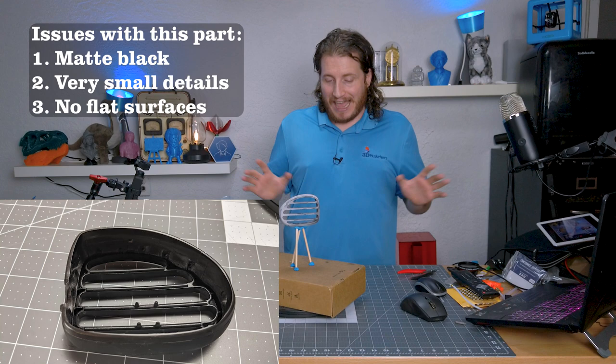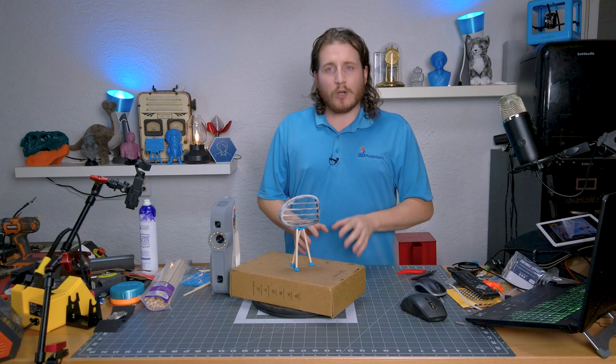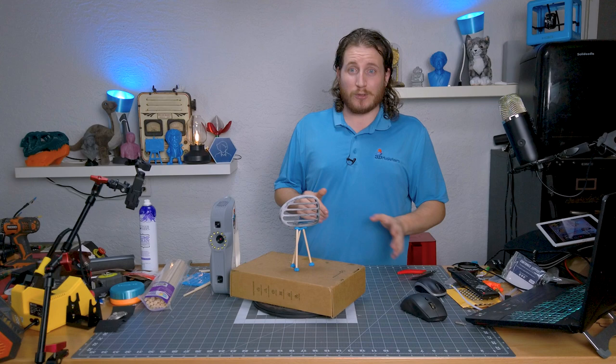This part is black, it's got very small detail, it does not have a flat surface on it, and the client needs all sides scanned. I've removed it from its turntable — the turntable was a cheap one from Amazon. I'd link to it but it's honestly hot garbage; it's got a bunch of triangles on it which is really bad for scanning.